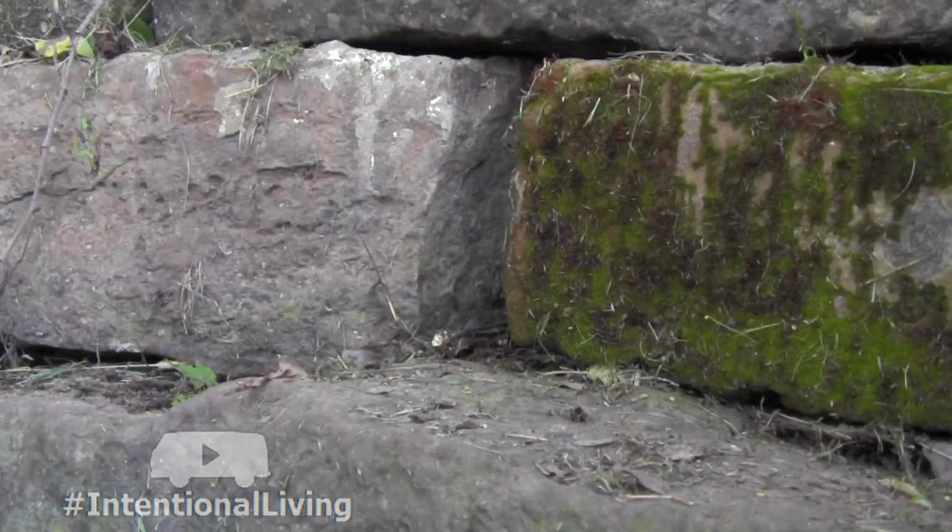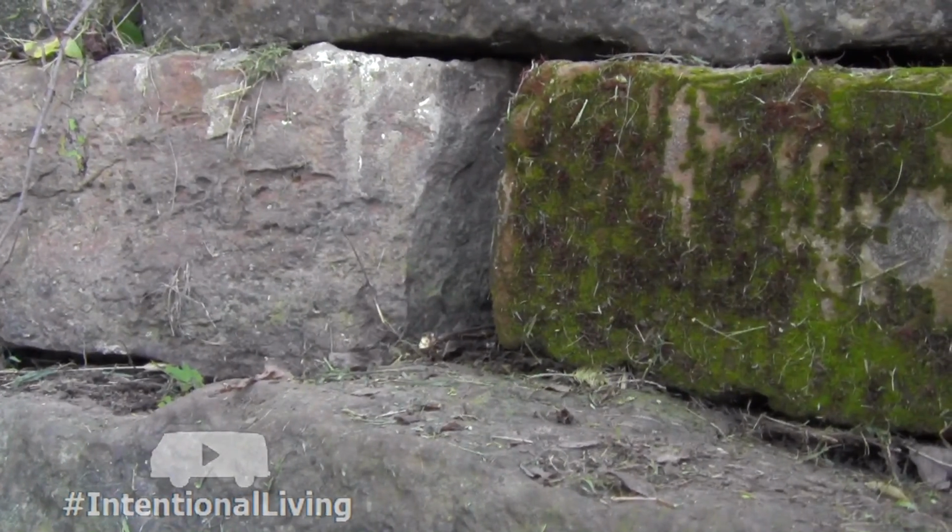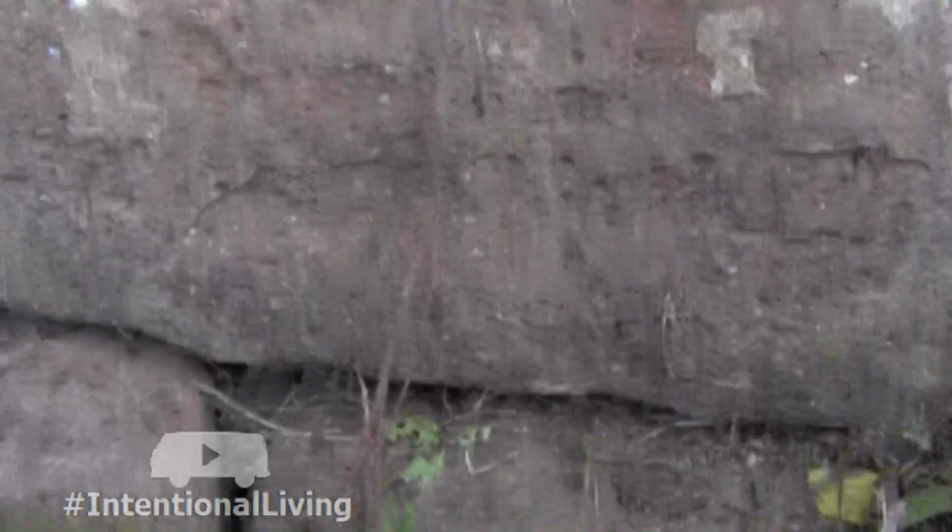Every one of them is such an individual, you can't just lay it out. You've got to have enough extras that you've got some play where you can find what fits. And I did use a rock hammer to chisel a few spots here and there. Of course it's really important to think like laying brick, with the one-over-two and two-over-one, so there's not a seam that just runs from top to bottom. They overlap one another.